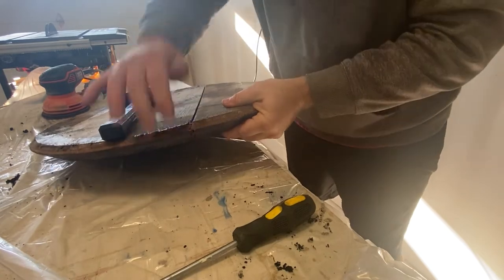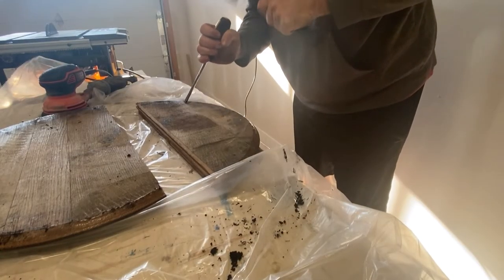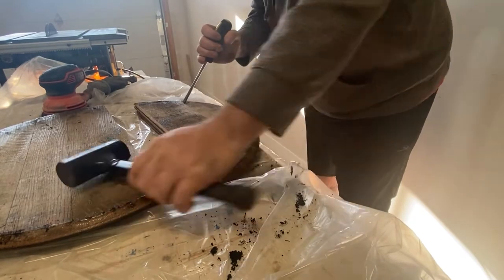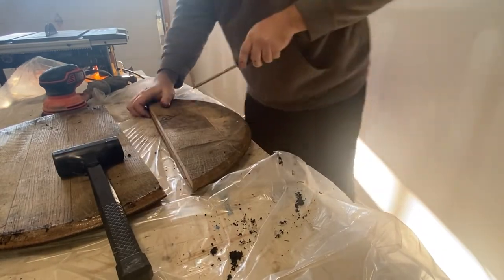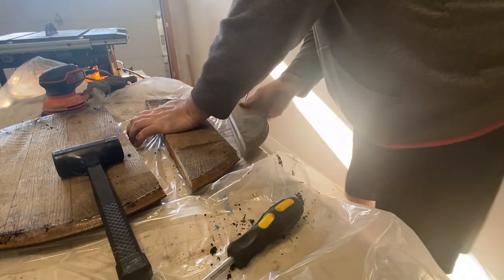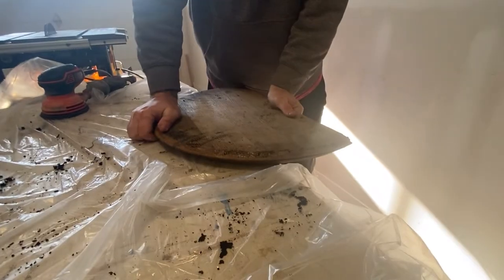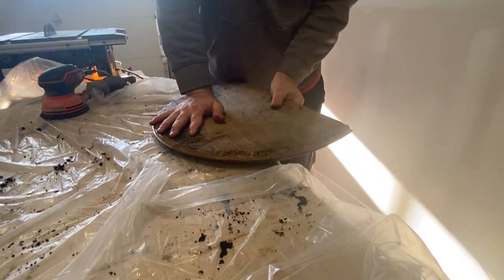The next step is taking the boards apart, just so we can glue them back up. Those barrel lids are well jointed, and as tight as those joints are, the further evaporation in those barrels will cause the joints to loosen over time. Even though white oak is incredibly hard wood, we have to be careful not to dent or chip it, so be careful when working these loose.